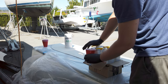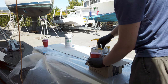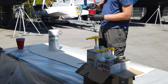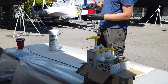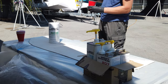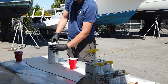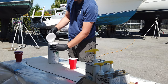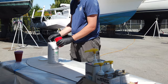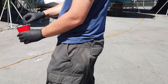In order to laminate the backrest together, we used three pieces of wood and thickened epoxy. Here Torrin's mixing together the thickened epoxy from West Systems. We've mixed lots of epoxy on this channel and we'll mix lots more, so I'm not going to show you much here. But you can see he's making up a regular batch of epoxy and then adding in some thickener — I think it's colloidal silica or something along those lines. The whole system works well together to give you a peanut butter consistency which, when slathered onto your wood, creates a really strong, long-lasting and waterproof bond.